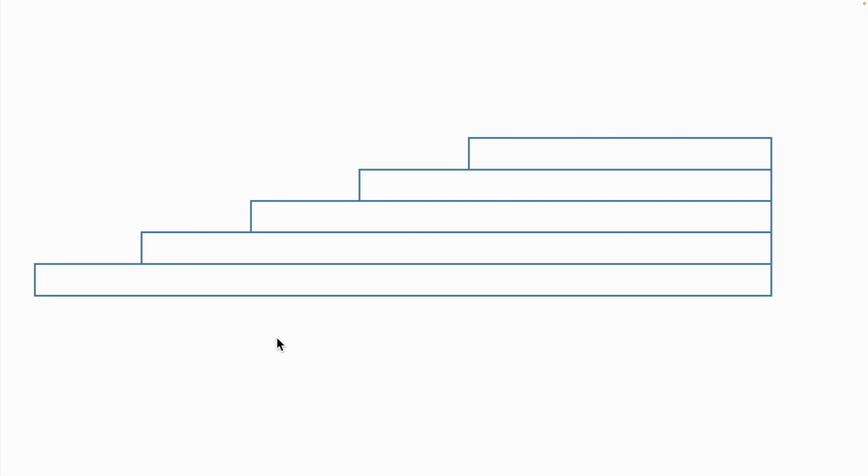I'll use this scale drawing of the ramp to briefly explain how I calculated where to make the cuts in the 2x10. First, I decided that the ramp will be 5 levels high. This gives me a total lift height of 7.5 inches. Remember, a 2x10, despite the name, is only 1.5 inches thick. After deciding how many levels I wanted, I then decided that each step will be 5 inches wide.